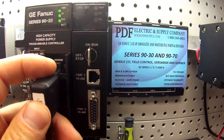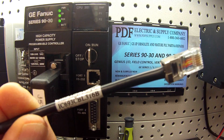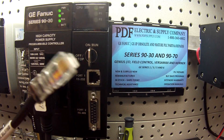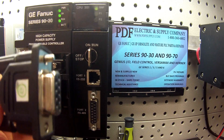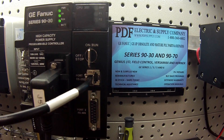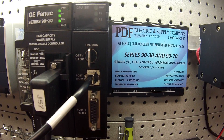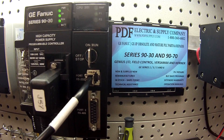I'm going to put that back and use a different cable to plug into our RS232 port. This cable is IC693CBL316 — it has what appears to be a phone jack on one side and a serial port connection on the other side that goes to the computer. I'll plug that in and again I'm looking for port 1 to be polling. And it is.